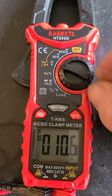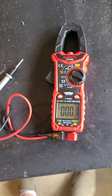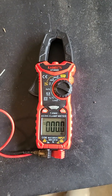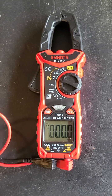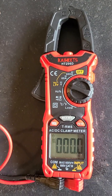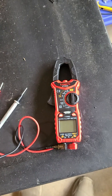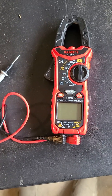Volt-wise, I was checking — you'll notice that says DC — I was checking the voltage across the positive and negative going to each part of the rear controller and the controller going into the mower motor. It was the controller going into the mower motor that was causing all of the amperage and all the volts on everything else to go haywire. Once I cut that, everything else read 39-point-something. Until I cut it, everything past the battery was reading weird — like zero, 0.5 — it was like a dead short. So that was the reason why. The first thing I did was check all that to make sure I had 39 or 40 volts to everything, and I didn't, which is why I went directly to the mower blade controller. When I cut those two wires, everything else read right.